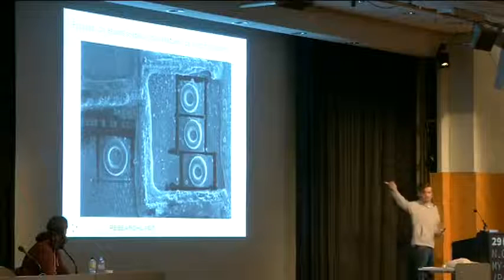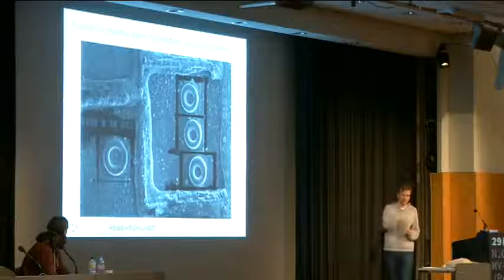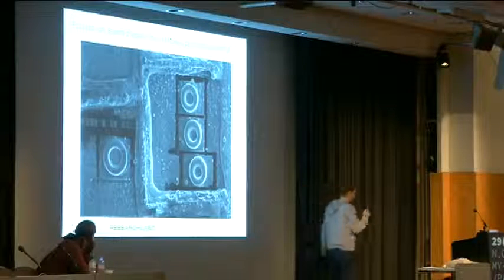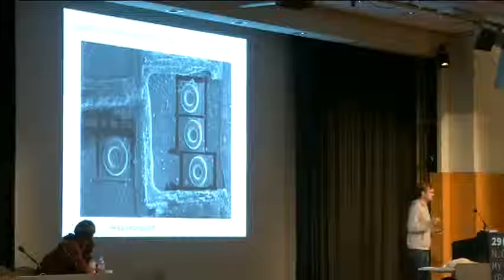Beyond the electron microscope, which could also have produced this image, it has certain active operation modes. If you accelerate the ions a little more, they don't just bounce off the surface, they actually shoot out atoms off the surface. So they destroy whatever you're looking at slowly, slowly. It's milling through the chip. And you can see how there are certain cuts in here where the FIB has already cut into the chip. Right? So that's the one active operation mode. The second operating mode is to put in these ionized gases certain other materials, for instance platinum gas, and the platinum ions will be thrown onto the surface and they stick wherever they touch the chip. So with these platinum ions, you can build up structures. And putting those together is really surgery on the chip.